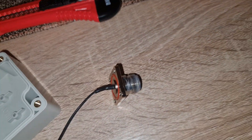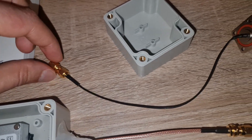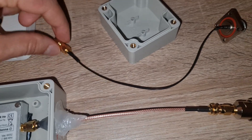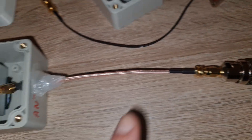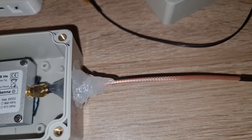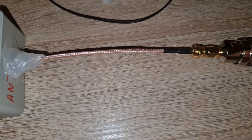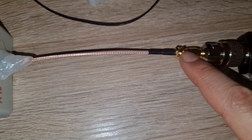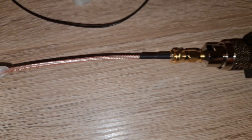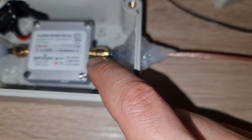You can buy a connector like this with a thin cable. These are from my outdoor enclosures — I tested and compared the cables and found the same type. This is RG316 or similar from Amazon. You need SMA male to SMA male. Buy directly the SMA male to SMA male type.